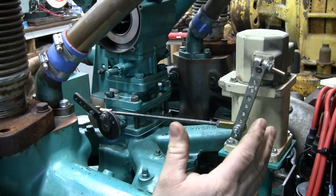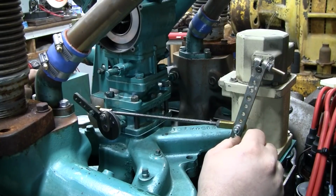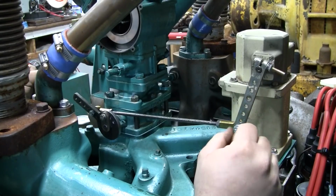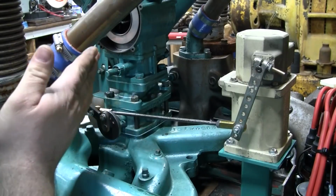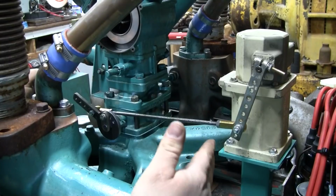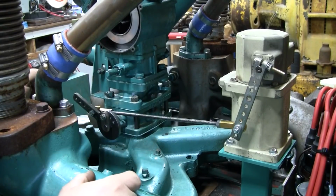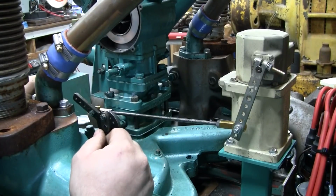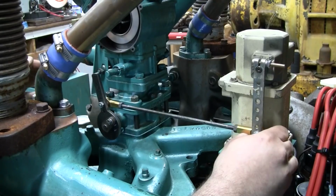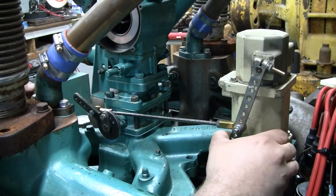Other than when you're doing a diesel setup, most of the time diesel injection systems, diesel pumps, are linear. So from no fuel to full fuel, all the divisions are equal. You get an equal rate of fueling increase, whereas you don't with a throttle, except for like the Cummins PT pump. The Cummins PT pump is more like a throttle body than it is a diesel injection pump.